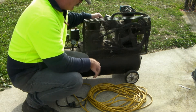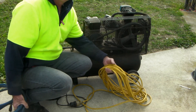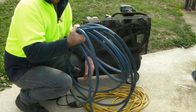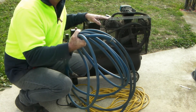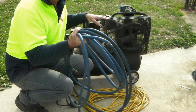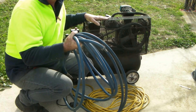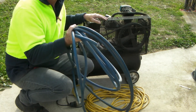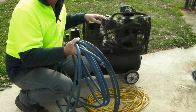There's a real easy solution for this — I'll show you what it is. Instead of messing around with an extension cord that's going to damage your machine, just get a longer airline. It's probably cheaper than an extension cord anyway, and it's a lot safer. You can just plug that into your workshop, run a long airline out to wherever you're going, and you can even work in the rain because your machine is undercover. Keep out of trouble, don't get yourself electrocuted, don't burn out your compressor. That's what I do now — just get a long air lead.